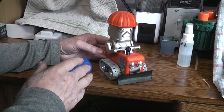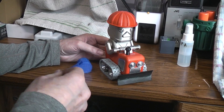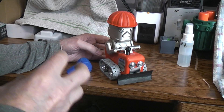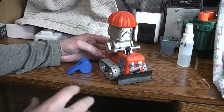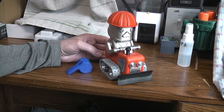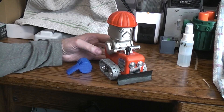First, I used a blue TT motor — that's the metal gear TT motor with the 90-to-1 gear ratio — so that the motor wouldn't be lugged down by driving the treads. It draws less current that way, so your battery life will be longer. In fact, instead of using three double-As you could use three triple-As, which would fit in and out of the toy easier.